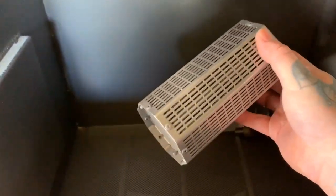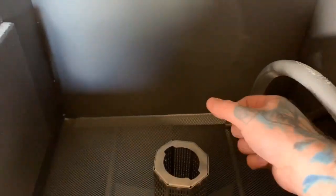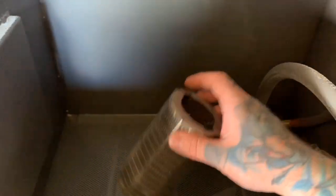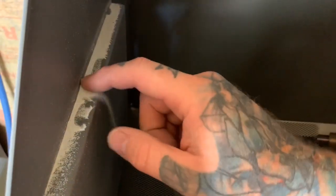And I show this on occasion. This is from Cerakote. It's just a little shake can. You can put little parts in there, put your nozzle in there and shake it around instead of having to hold every little tiny piece. And I keep the Zerblast in this cabinet. What it does is it creates little micro dents, which gives it that matte, shiny kind of finish. So that's what goes in this cabinet.